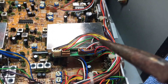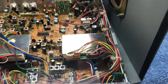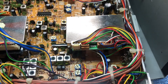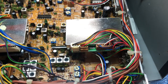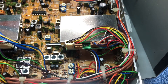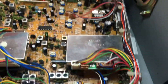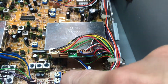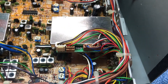I have a trace back where the volume control goes into the board, and that's where I'm going to make my junction connection. Basically, we're going to find the wiper side of the volume control, and then we're going to have that go to ground — that's where we'll add this capacitor. It goes between those two connections. On the 4800, this is on the J5 connector.